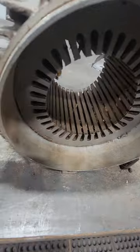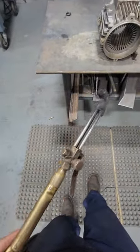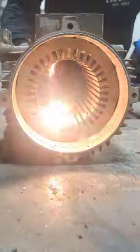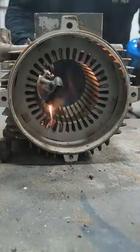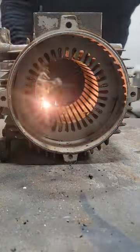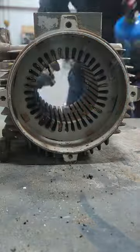I'm going to show you a little trick I learned from an old timer. You can see a lot of that paper is still held inside the slot. I sandblasted it — the paper's not coming out, it still has varnish on it. So we're going to use this torch with the tip off and burn every little piece of that paper out of these slots. We'll sandblast it one more time and get it perfectly clean.